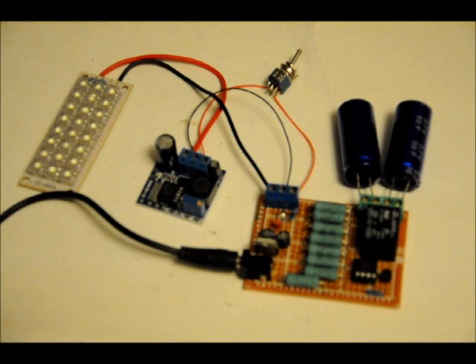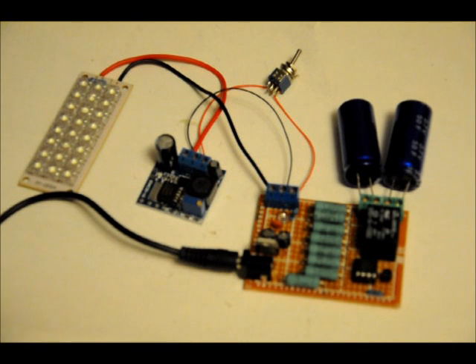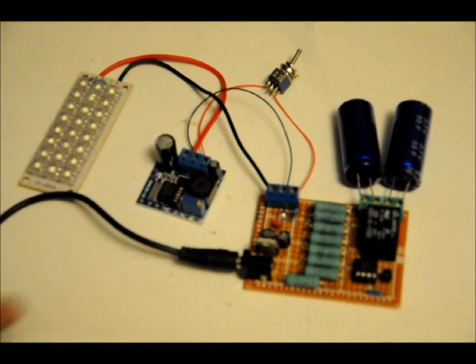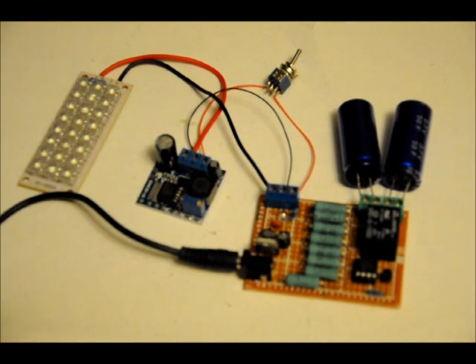Supercapacitors — I've written a guide on them that can be found on Instructables.com. They can charge really, really fast and discharge really, really fast because they've got a very small internal resistance. However, I only had this type of resistor and some 9-volt, 1-amp wall transformers handy. So I had to configure it so that half the power was going to the capacitors, with a reserve of about half the power to run my digital circuitry through this regulator. I didn't want the input voltage to dip below 7 volts because I needed 7 volts to the input of the regulator, which feeds 5 volts to my 5-volt relay and my PIC-10F222. You can go to Instructables.com to see exactly how to build this — I've added a lot of detail.